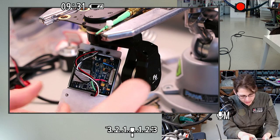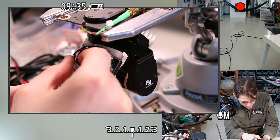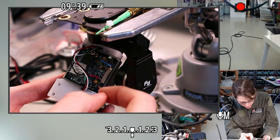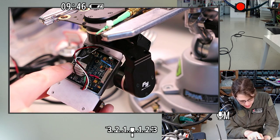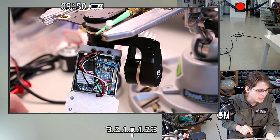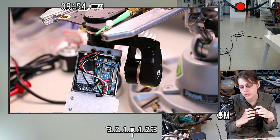It measures movement using a shaft encoder attached to the pulley, and it measures force by having the pulley itself on a load cell. One problem that I hadn't quite solved with that was, how do you keep the cord in contact with that pulley? I'd been assuming I would use some kind of additional roller on a spring that would just press the cord on there.